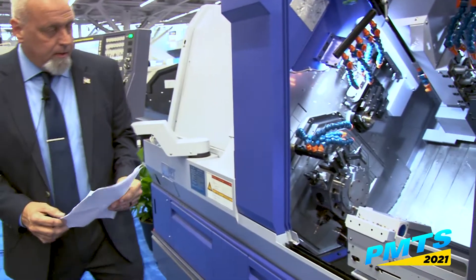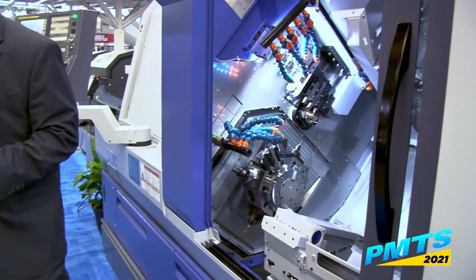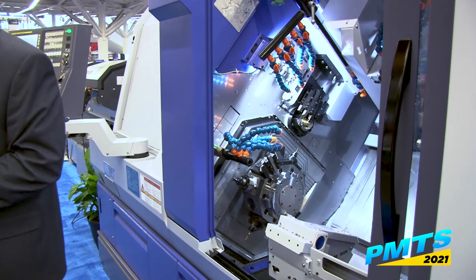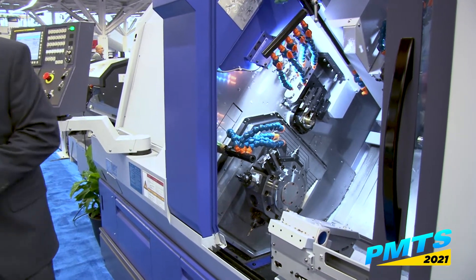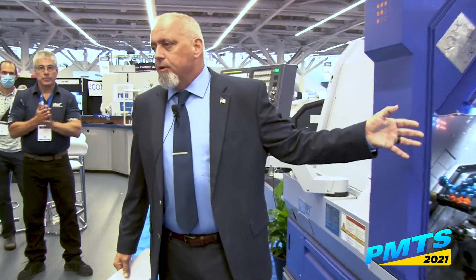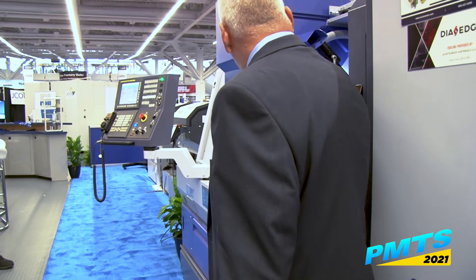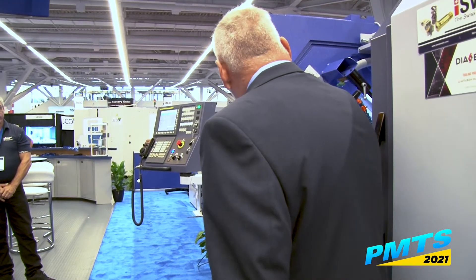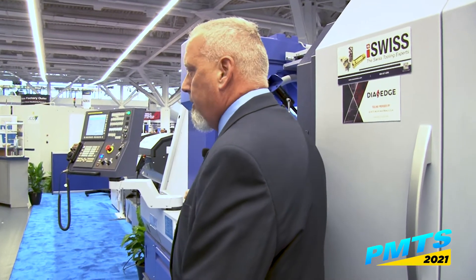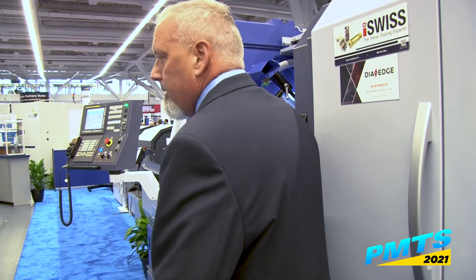Moving on to the workroom — a lot of the benefits of this machine are not only the size and rigidity, but how many tools you can fit in it. We have customers that run millions of parts or low quantities, and having a machine capable of holding this many tools lets you put standardized tooling in to reduce setup time. We have a 10-station turret, gang slide, and back working. The 10-station turret is a quarter-turn — that's what differentiates a Type A from a Type B. We're demonstrating a Type A, which has the quarter-turn quick release to get holders in and out, preset them offline, and put them back in. Each station, depending on your process, can hold up to six tools per station.